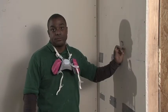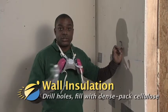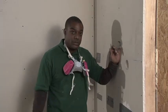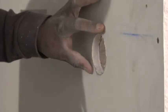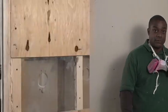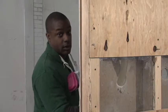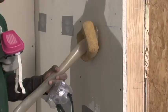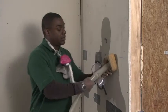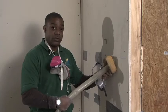This is our wall blow station. Here we'll demonstrate how to get insulation into a finished exterior wall. The first thing we do is drill a hole in the finished wall, either from the interior or from the exterior. The next thing we do is insert the fill tube into the hole, going up until we hit the top plate. Once we get it to the top plate, then we're going to back it off about a foot.